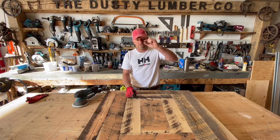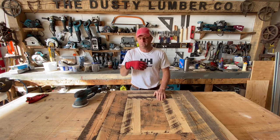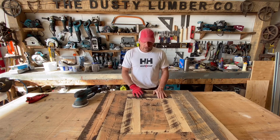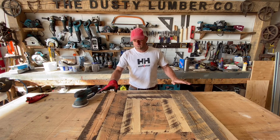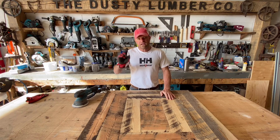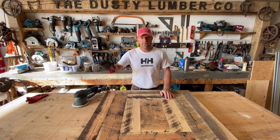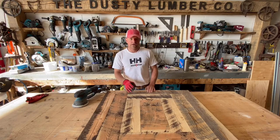The only uncertainty is in that quarter inch of veneer that I have. But because we've seen the bottom side and can see the top side, we're going to use way less epoxy and have way less issues. The first step is to rough sand the whole thing, get it nice and flat, and expose the barnwood character. Then I'm going to flood coat it with the black stuff, put a stain on for color before it goes to the trade show, and then put the first coat of epoxy on.